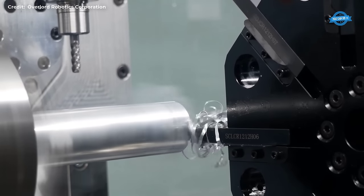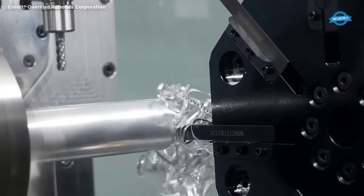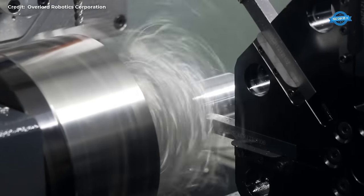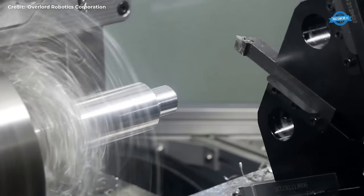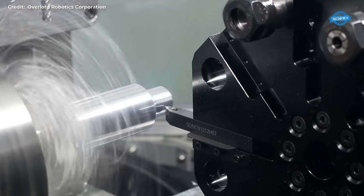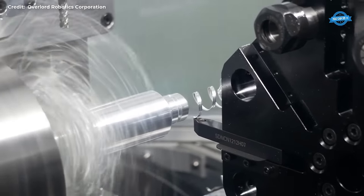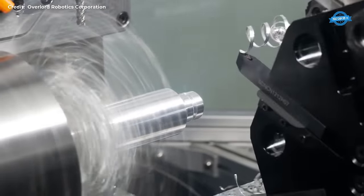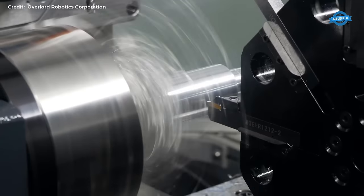With a large 2 inch, 50mm spindle bore for bar work and the ability to mount chucks and collet noses of various sizes, the Swiss Mach is capable of machining a wide range of parts, from small needles to large tubes and bars. The included ER40 tailstock further enhances the machine's capabilities, allowing for long parts to be machined between centers or for holding large cutting tools and deep hole drills.